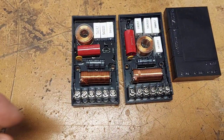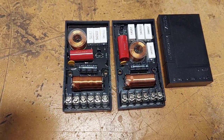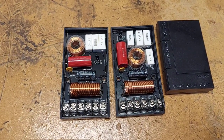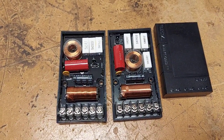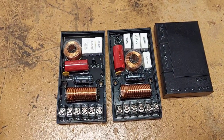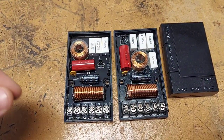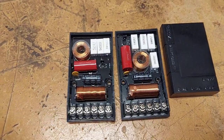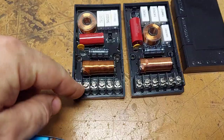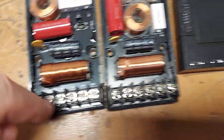The '+2 dB' label isn't really a genuine plus 2 dB — what it really means is just no resistors, so it's naturally that sensitive. The correct way to label it would be 0 dB as the loudest, and then negative two and then negative four. Regular screw terminals are marked both on the PCB and on the cover.